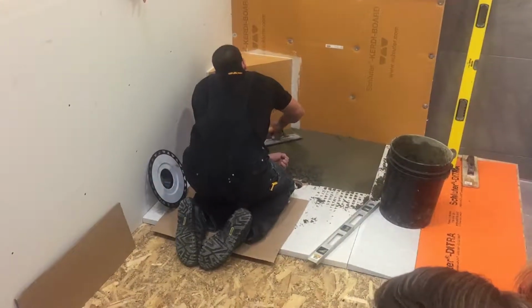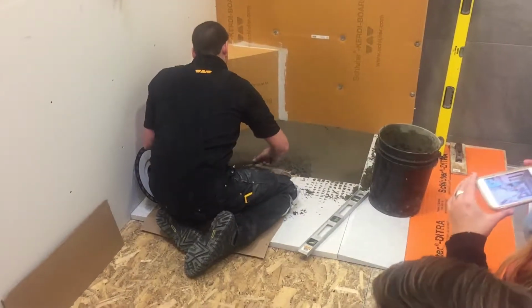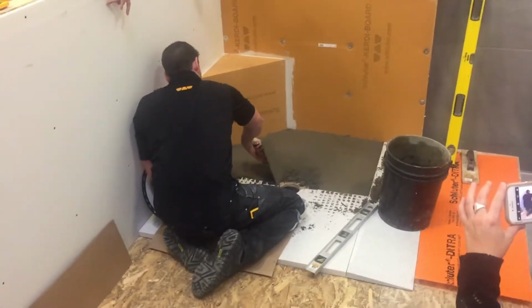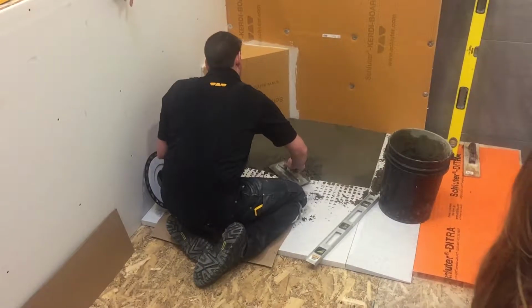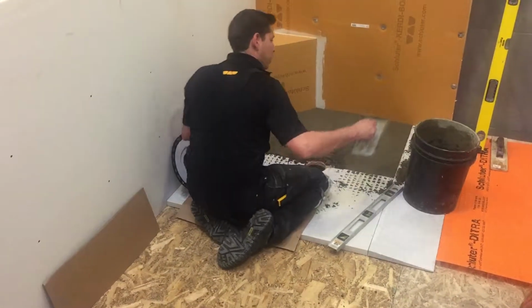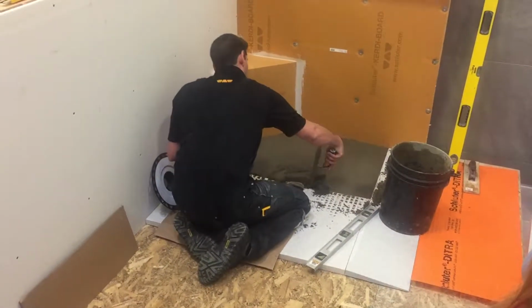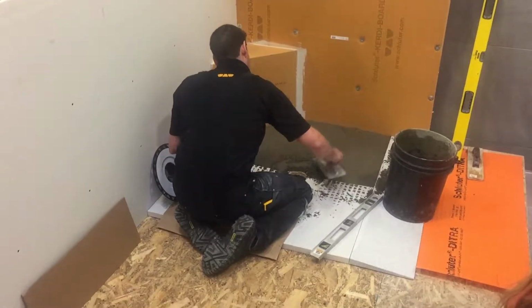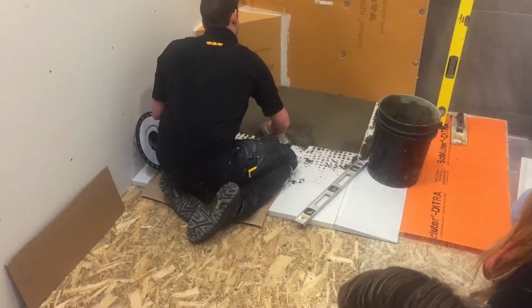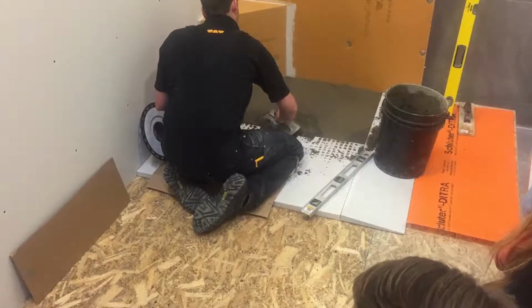I think I've seen a demonstration of this. Yeah, definitely. Yep, they have their own. It's already mixed. Yep, all the normal powder manufacturers have their own version of a floor mud. Really, at the end of the day, it is just a 4-part sand, 1-part Portland mix. There might be a few other tweaks to it, but that's its general basis.